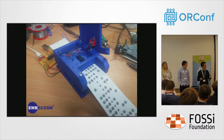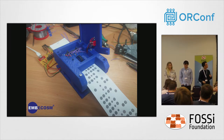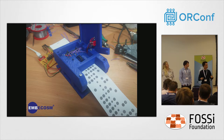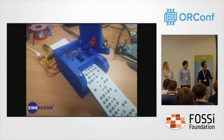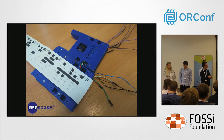The original EDSAC used five-dots-wide paper tape, which is why we've used five dots wide. This paper tape reader was probably the hardest peripheral to make, since reading things optically is generally quite hard. We have six green LEDs — chosen because that's the highest sensitivity of the LDRs we could get — which shine onto the paper. We reflect light off the paper and detect it with LDRs, which feed into an Arduino clone at the back. There are also holes for wires down the side so they don't get in the way of the paper.